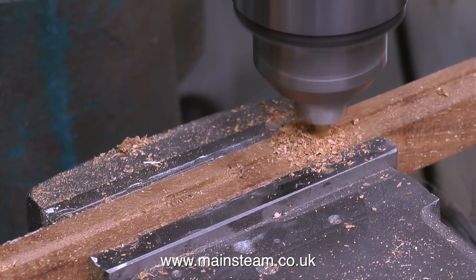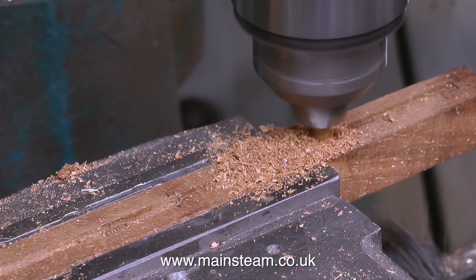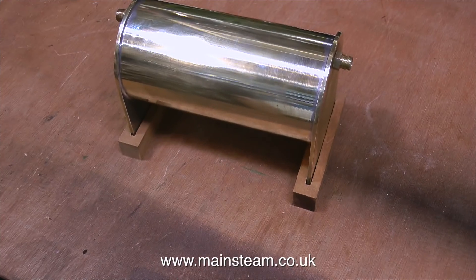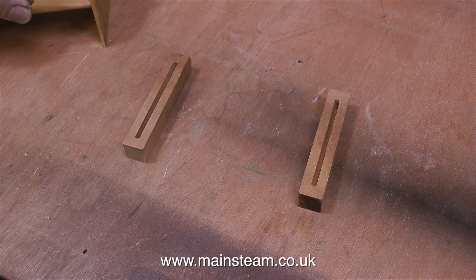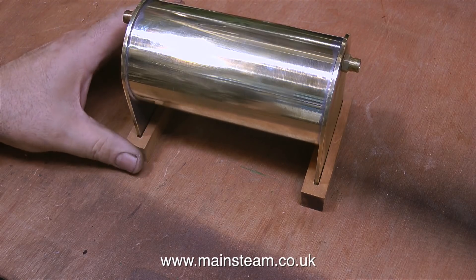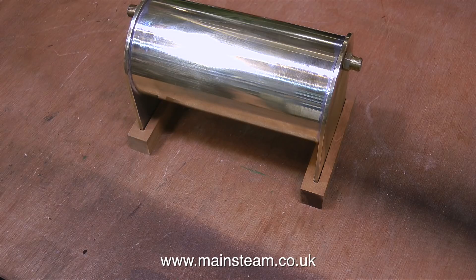This clip shows me cutting the second slot, and I'm going to speed up the video. And now here is the finished condenser oil trap, and as you can see it just sits in these pieces of slotted mahogany. Before I can fit the condenser into the boat, I need to shape the bottom of these pieces of mahogany to fit the curvature of the hull, but eventually I will just place the condenser complete with the wooden mounting rails in the bottom of the boat with a generous amount of JB Weld spread underneath the mahogany mountings. And after 24 hours when the JB Weld is cured, I can simply lift the condenser out of the slots, leaving the slotted supports inside the hull.